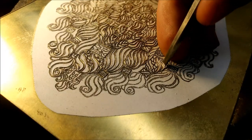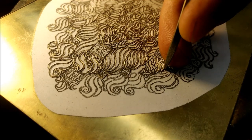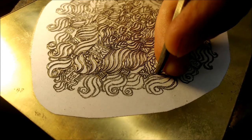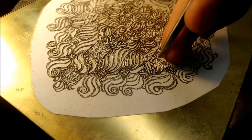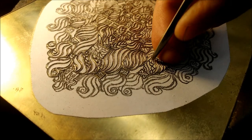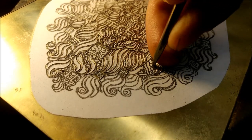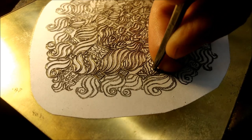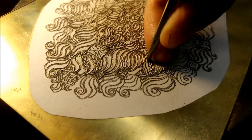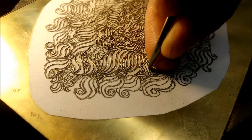I'll have to hand-draw them on or do them individually with the paper pattern transfer, depending on how comfortable I feel with the design. Plus, all the volumes would change. Naturally, there's so much wiggle room for this style of relief to expand and change and grow. That's why putting in the line work for the beard makes sense — the lines aren't going to be deep, so as the metal expands, it's not going to damage the potential future of the piece. You shouldn't have material failure.